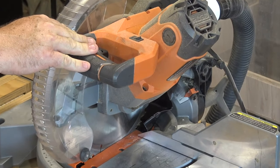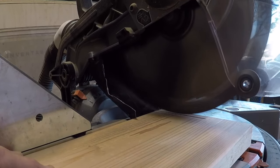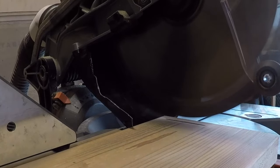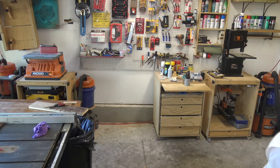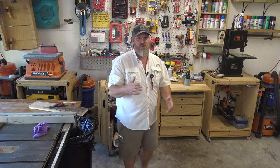Here you can see how the actual shoe is behind the fence. Let's check it out and see how much extra dust we get. Making that little dust shoe is going to directionally channel the dust more up into the vacuum and down the holes — it's going to capture about 15% to 20% more dust. I actually had a bag on one of these at a job site, working inside, and I had to cut a bunch of MDF. I built one of these on it and it cut the dust down considerably. That's an easy, quick thing to do to lower your dust off your miter saw rather than building a big enclosure. I'm Stoner Erickson from Erickson Design Company and we built something.